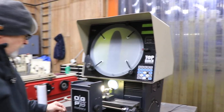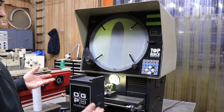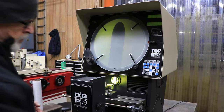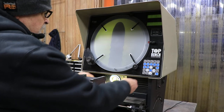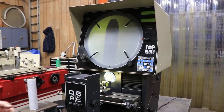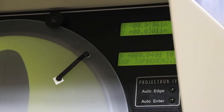Put this little item there. It also has built-in internal surface illumination. You could shut that off and just have the profile, but this also has surface illumination without those little external lights you'd normally have to move around on other machines. OGP does it internally, and it's pretty nice — you don't have all that external hardware that always seems to want to move on you.